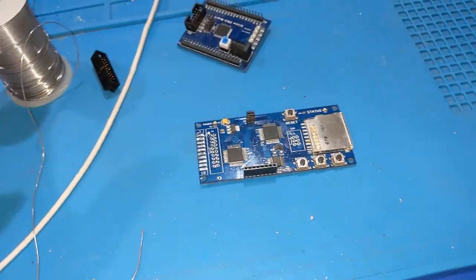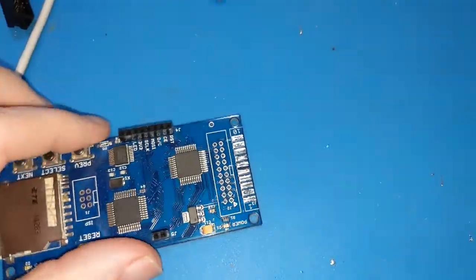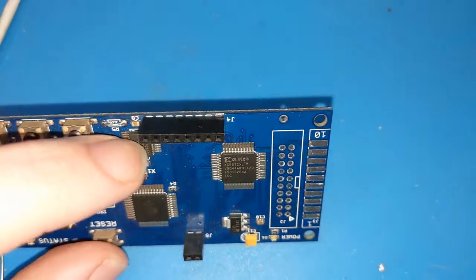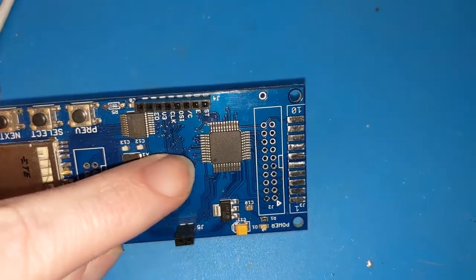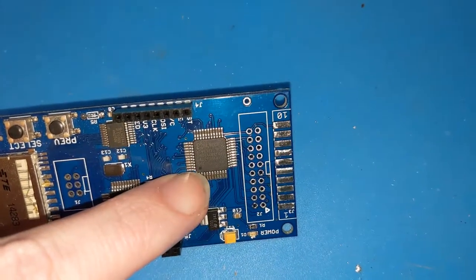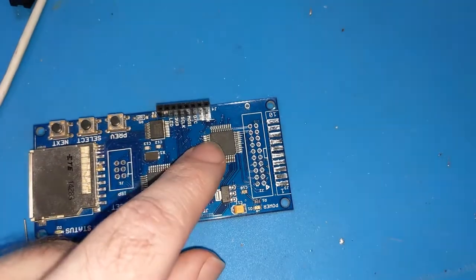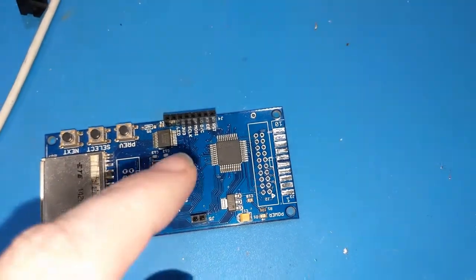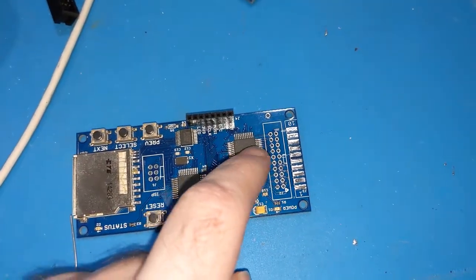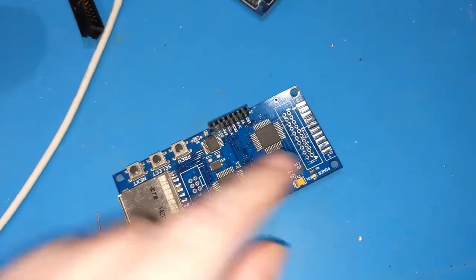Now that I took the connector off, I want to talk about something. So, this CPLD, as I've already mentioned, I think, but I'm going to mention it again because these are going together in clips. This 9572XL is a 5-volt tolerant part. Now, the problem is the 5-volt signals, if they are present before the 3.3 volt line stabilizes, it can damage the chip, especially if full current is allowed to pass through. I'm experienced with this chip because I've used it on my Macintosh Portable RAM designs. And the one thing I did with that design, and I'm not seeing a failure yet, is I put series resistance between the IO lines and any 5-volt sources unless it was going through a 3.3 volt transceiver.